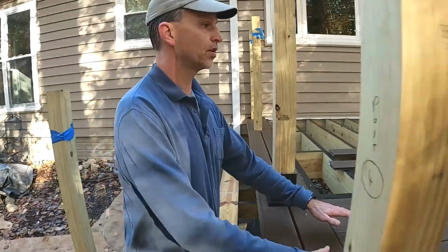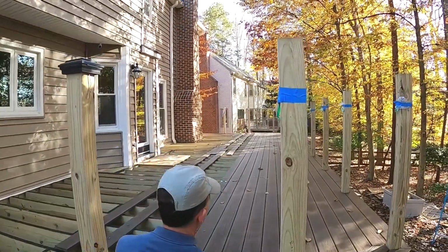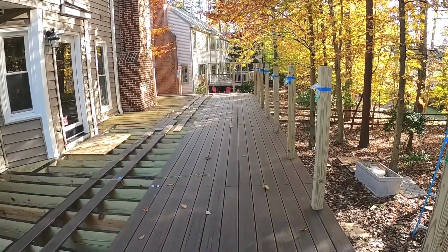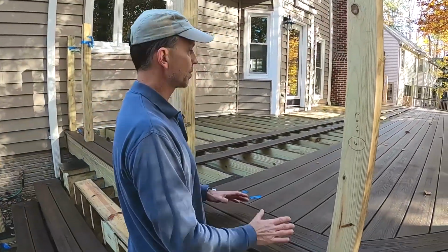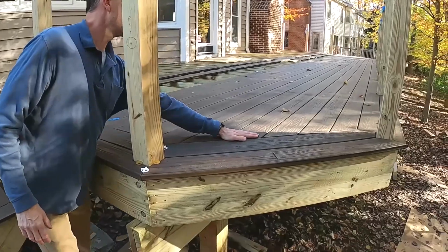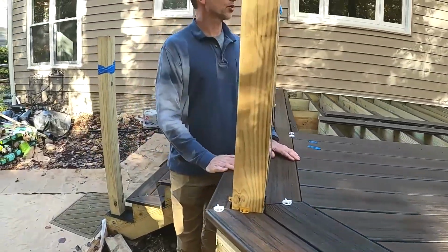And so these boards are going much more quickly, and I don't know if you can see, if you maybe go a little bit higher on the angle, you can see that they're alternating gaps like this. The gap on this board is about 9 feet down, but then the next one is about 19 feet down, alternating seams, because all of the boards come originally 20 feet long, so we're basically getting 9 foot sections and 19 foot sections for the long part of the span. Of course, we had to do some mitering on the corners here, and that was a little bit of extra work, but it's coming together, so we're pretty happy with it.